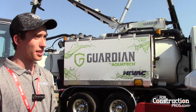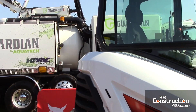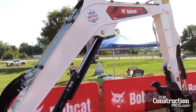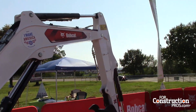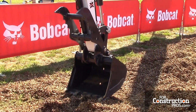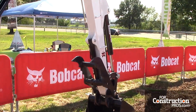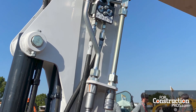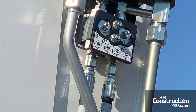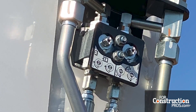Some of the new features we brought into the three-ton series R2 excavators were an integrated rod eye lift point on the bucket linkage that comes standard. We also moved our auxiliary couplers to the side of the arm instead of the boom, so it's easier to access. We also have a clamp diverter option, so if you want to take the flow from the clamp and move it to the auxiliary flow, it's simple to do with a wrench.